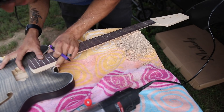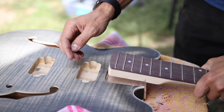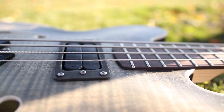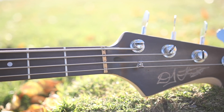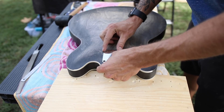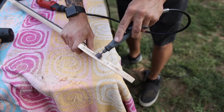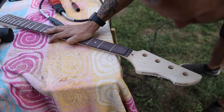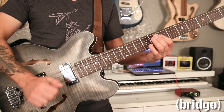Now that all the excess material is scraped away, I can trace in where I want my neck pocket to be and route it out, then touch it up with some files to make sure I get a really nice tight fit. I did end up routing that neck pocket quite a bit deeper later on because I wanted a super low playable action. This neck is just one I had left over from a previous project, but it is the right scale length — 34 inches and 20 frets. The key difference is this is a four-in-line headstock as opposed to the two-plus-two that came with the kit, which gives it a really unique, funky look, very similar to the old Fender Starcaster basses.